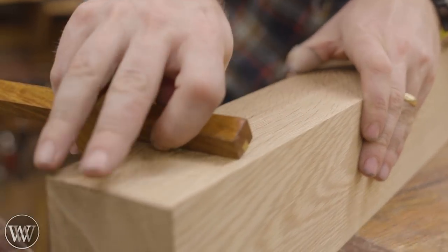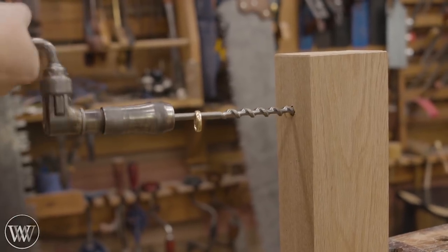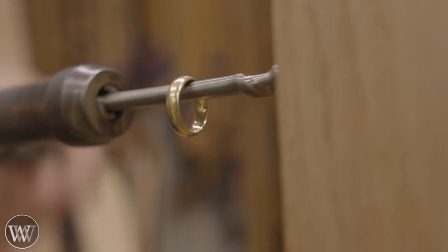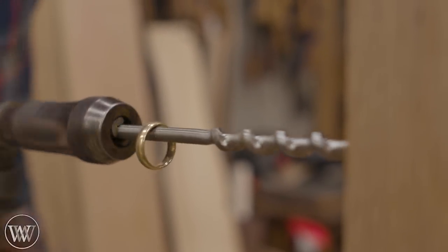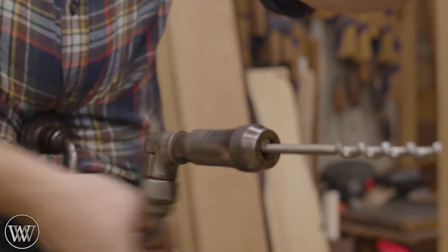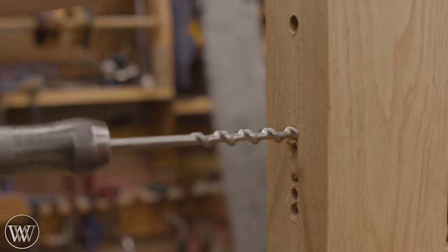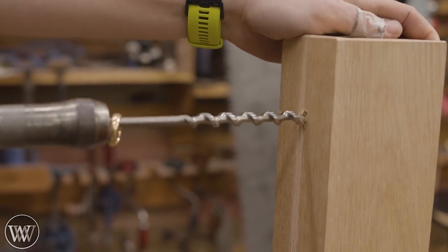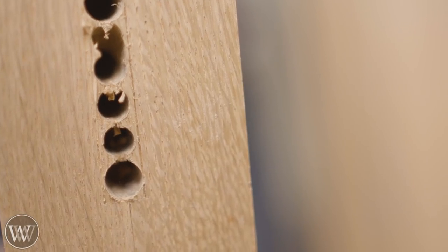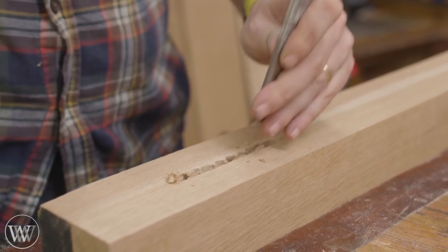Then put in the width of the mortise - the thickness of the mortise - which is a half inch. And now the boring part - oh yes, the boring part, everybody's favorite. I don't actually drill out a lot of mortises; I usually save that for the big ones. In this case it's four inches deep and it's only a half inch wide, which means a whole bunch of holes and it takes a long time to drill out each one. Each mortise I think I drilled ten holes from either side, so each mortise was twenty holes being bored, which takes a long time with a brace and bit. But it saved a little bit of time from just chopping it out, because chopping down two inches from either side takes a lot of time. In this case because it's so much bigger I prefer to bore them - if I was only going down two inches then I'm just going to hit them with a chisel. So I bore the holes from one side, then turn it around and bore the holes from the other side, and I've got most of the material taken out.